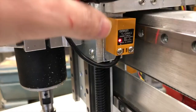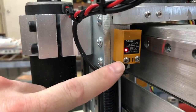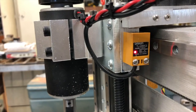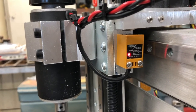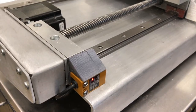The thing I'm most proud of is getting actual proximity sensors on here — two up here and one at the top of the Z. I learned a few things dealing with these. Obviously there's normally open, normally closed, NPN, PNP. If you go on DigiKey, similar ones are going to be $70–$80 a piece. I wasn't going to spend that, so I got five off eBay for about $20 — just overstock or discontinued leftover.